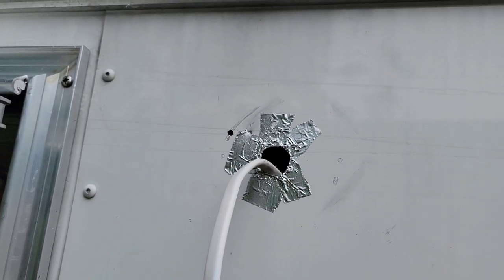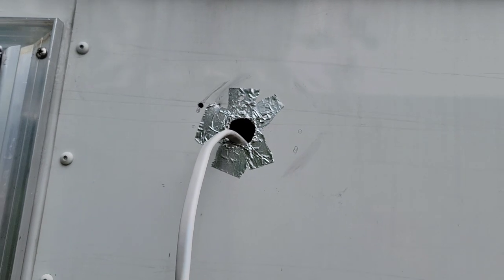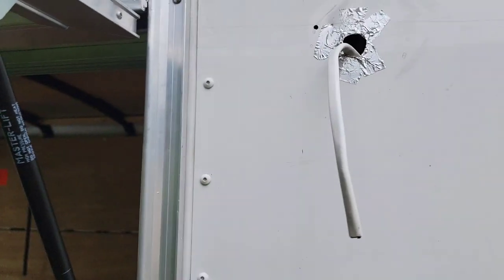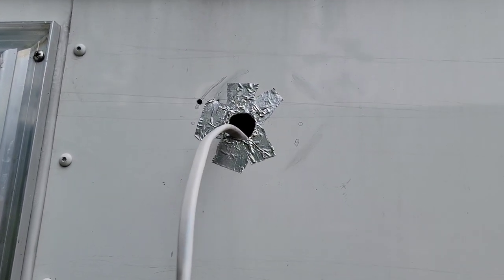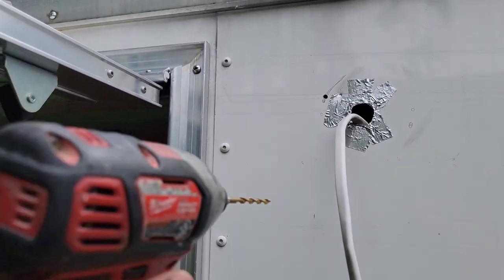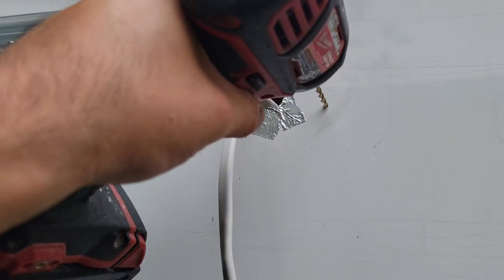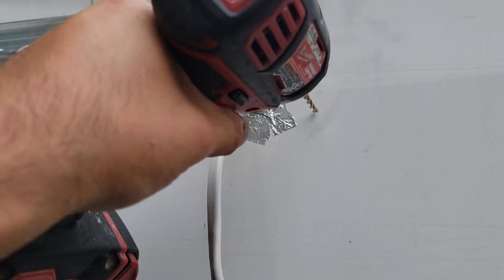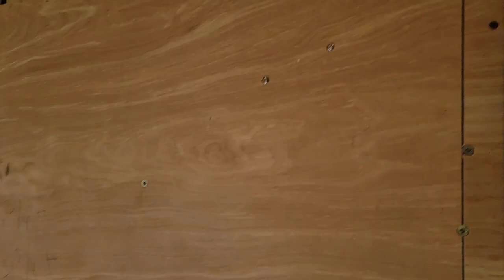And the reason we do that is because if I put screws right here on the skin, the light is not gonna get held up because there's nothing back here besides just literally this little sheet of aluminum. So what I have to do is take a screw and put it all the way across to the other side with the nut and a bolt. And I'm gonna show you how we're gonna do that. But for now, we just know that we just have to drill all the way across to the other side, and then we're gonna pick something up at Home Depot.